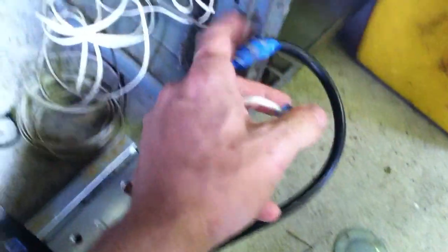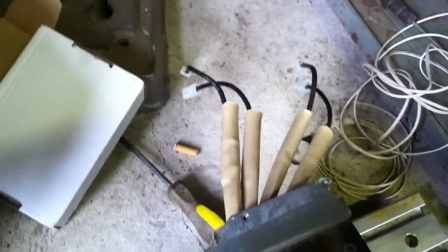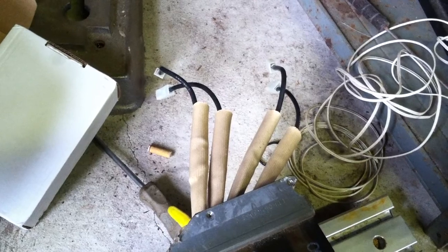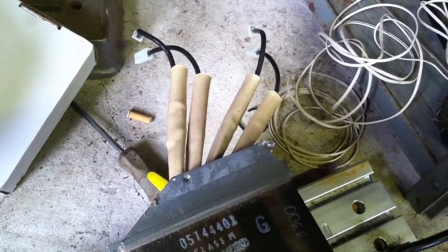I was thinking, as soon as I put power to these with nothing hooked to these guys, this guy popped a fuse like right now. I'm not 100% certain why. I was hoping to be able to hook this guy up to 120 and then series the outputs and use it, just plain use it. It did not seem to be the case.